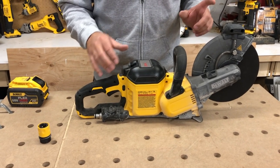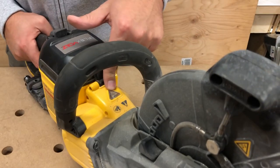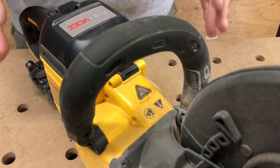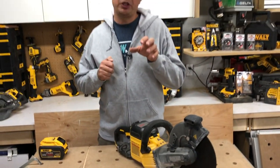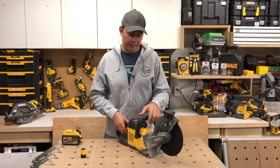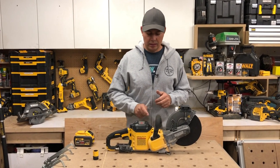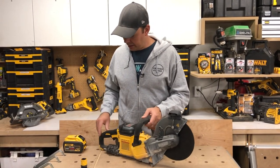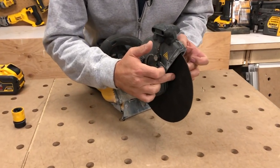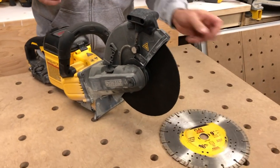It has a light right here — this is really important to know about. If you are cutting concrete or rebar and this light flashes at you, you've got to ease off the pressure a little bit. It's basically telling the operator that you're pushing on it a little too hard, so just ease off when you're cutting. With concrete especially, that's when you start to see this light up a bunch. The water comes through, goes through the unit, and it sprays out on both sides of the blade — that would be when you're using the concrete blade.